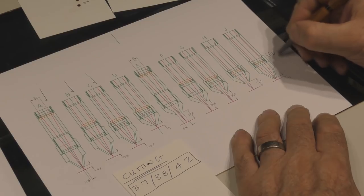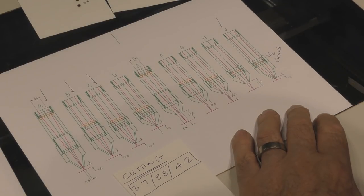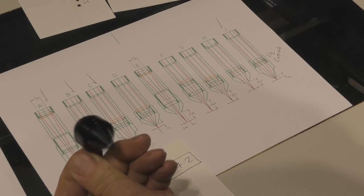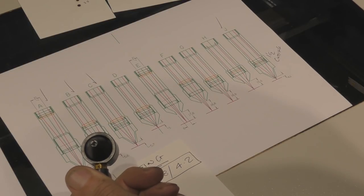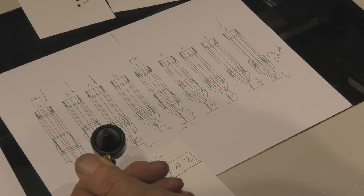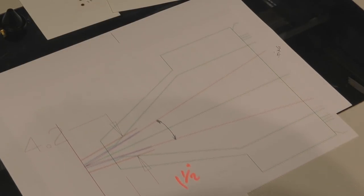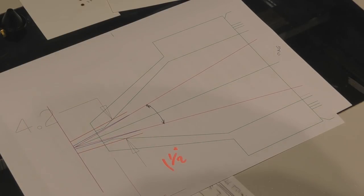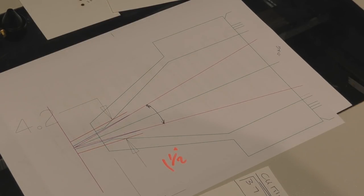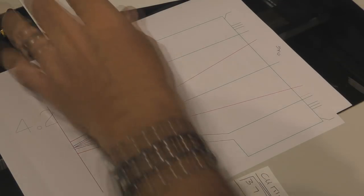With a standard long nozzle we've covered all four lenses. We just need to decide what size hole to put in the end — it certainly isn't 2.5 millimeters. You could argue the designers were actually clever, intentionally letting only the high energy part of the beam through as an occlusion to stop the low energy corona from causing burning. But I'm not sure that's truly the case, because I regularly see that black mark around engraved dots.